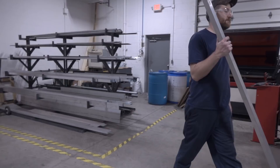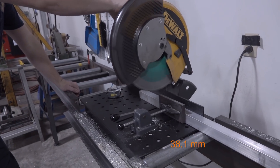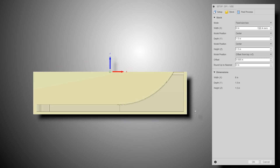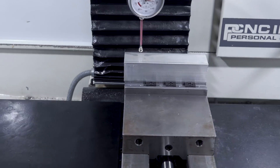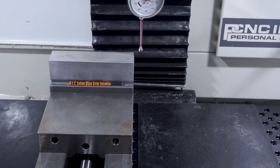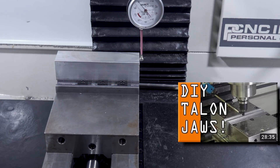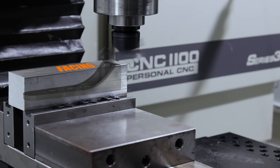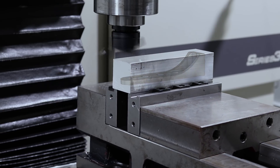Grabbing some raw material to cut off a piece on the Saunders plate and the DeWalt chop saw. Material is one and a half inch square 6061 aluminum. As you can see in our Fusion 360 stock, we're saw cutting a six inch width — that gives us plenty of room on each side to clean up those faces. Holding it in our DIY Talon Grip vise inserts; you can buy them ready-made from Mighty Bite, or these are the ones we made back in Wednesday Widget 126. Quick cleanup of the top face with a Superfly — we only have a small area that will actually be left, but this helps clean that up and gives us a good datum to work off of.